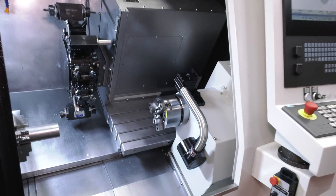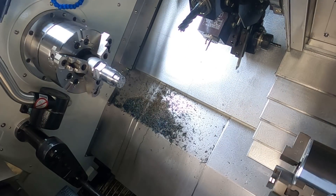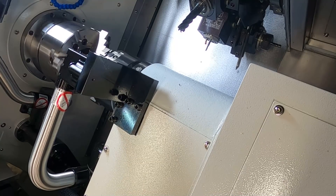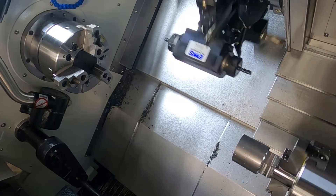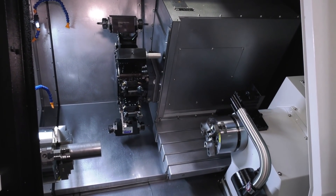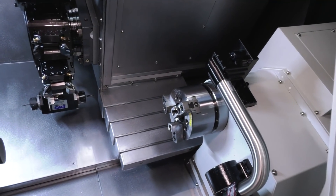You can see inside the machine we now have two spindles on an XYZ, which means you can make parts in one hit. How many times have you taken a part from machine A and put it on to machine B in order to finish it? By doing that it not only takes time and needs an operator, but there's also a lot of risk involved in the reliability and precision of the component. With a sub-spindle machine you can machine parts in one hit.